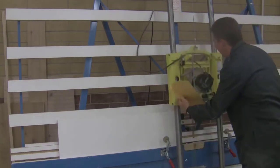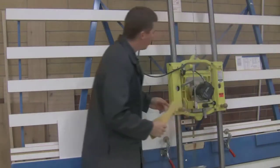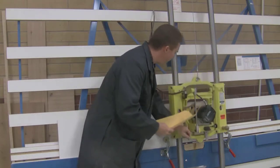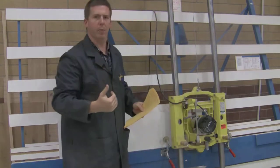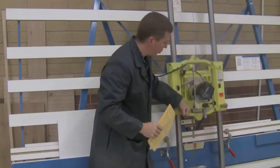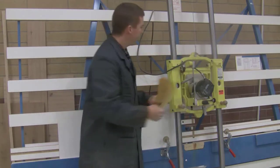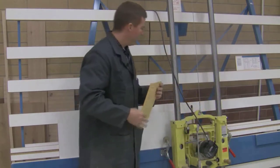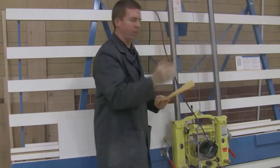It will work if I push down — it will cut and does a pretty good job cutting downward. The problem is the way that the blade is spinning: if I cut going down, it takes all that sawdust and throws it up into the air, and I pretty much get covered completely from head to toe. If I start from the bottom and go upward the way I'm supposed to, it all goes downward into the chute that catches it and sucks it away. So you always want to cut pulling upward — that's why we wear safety glasses, because it goes right in front of your face.